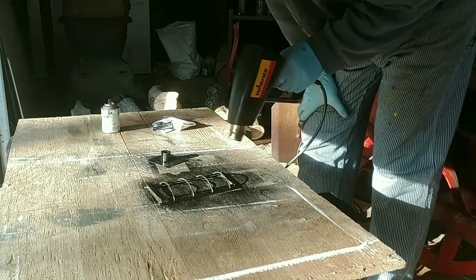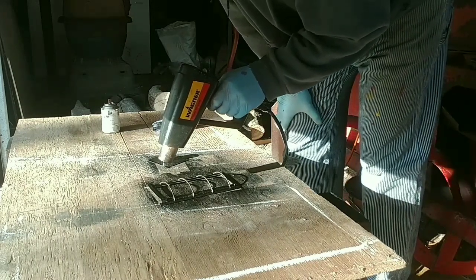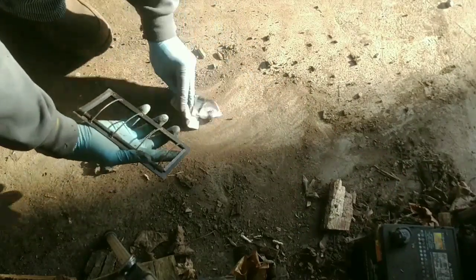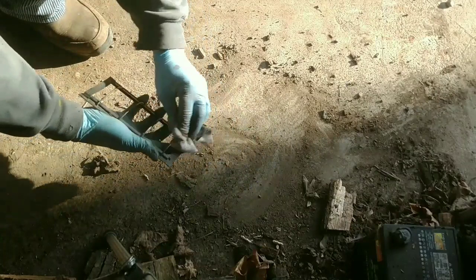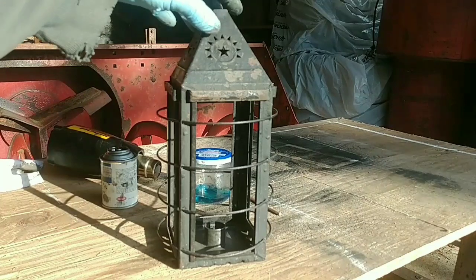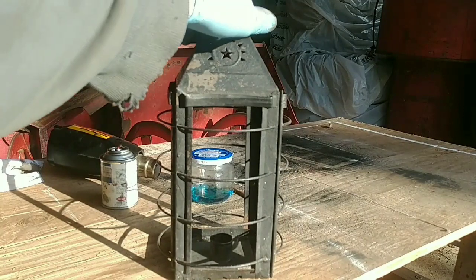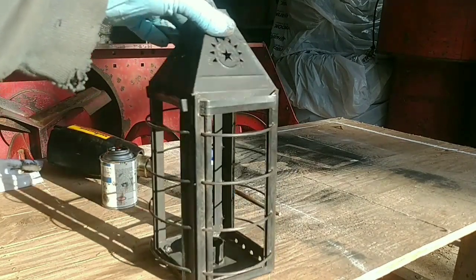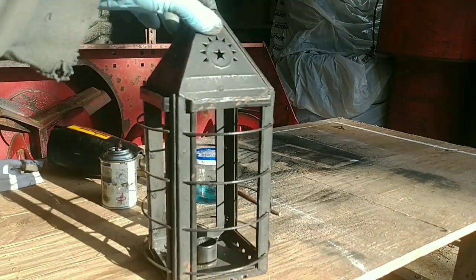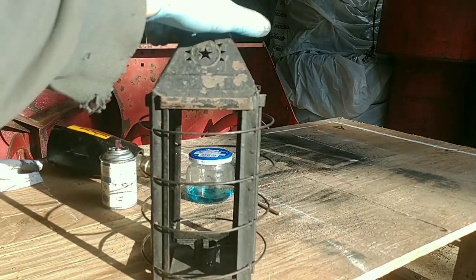I'm drying it with a heat gun again, and then I'm going to rub some sawdust floor sweepings, like concrete powder, dust, dirt, sawdust. And this really isn't to make it dirty, but it burnishes the surface so that the new paint doesn't have a new paint surface. And the other thing I did before I painted, I thought I got footage of it, but I guess I missed it, was a dish soap. I painted on dish soap for a resist.